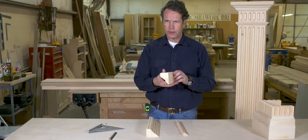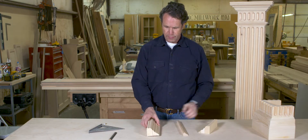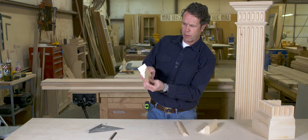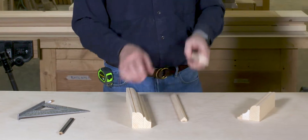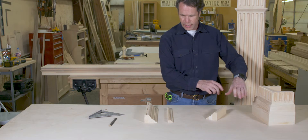The capital at the top, which looks like this — those moldings here — is made up of three moldings. We have the abacus at the top, which looks more like an echinus, and then the moldings underneath. Those three moldings put together create our capital, and then you have the neck, and then you have the astragal underneath, which is this molding. There are our three moldings, with the neck in the middle, and then the shaft runs down.